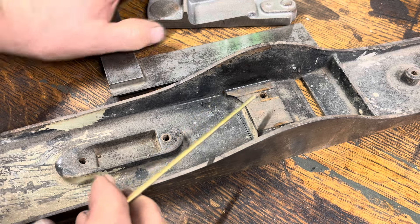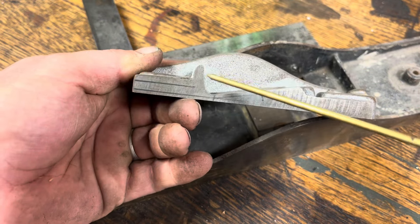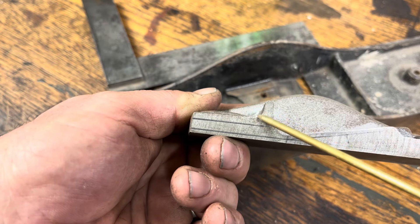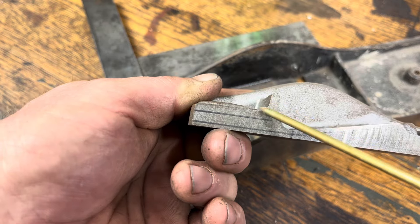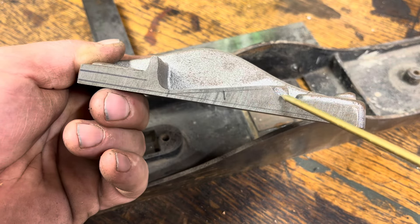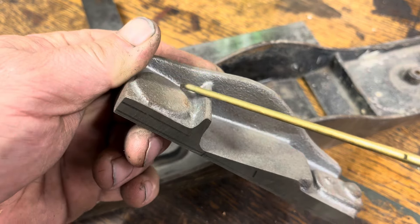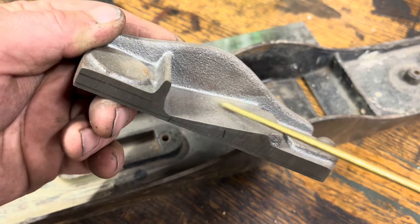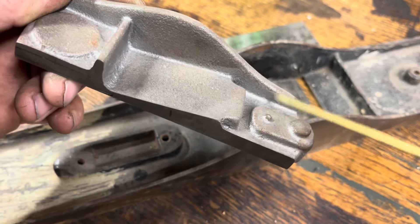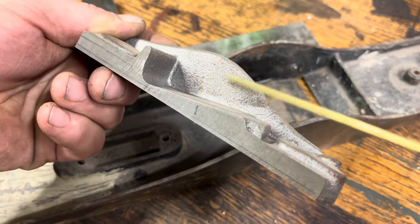The second important element is fillets. This cast iron ductile iron plane is a better example — anywhere two surfaces meet, there's a little cove, and that's called a fillet. It prevents sand from sticking in those corners. You can see them all along these edges. If you don't put those in, when you pull it from the mold, sand will catch right there and prevent you from having a good casting. I learned this the hard way about ten times trying to make my first castings. Once I figured the filleting and drafting out, it went a lot smoother.